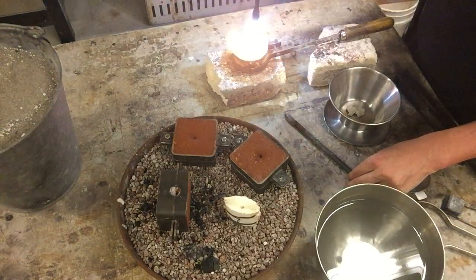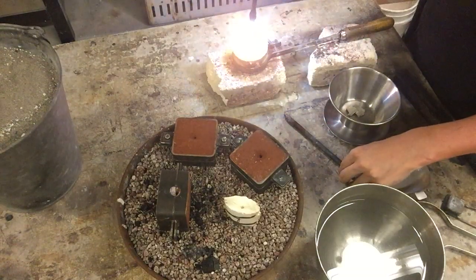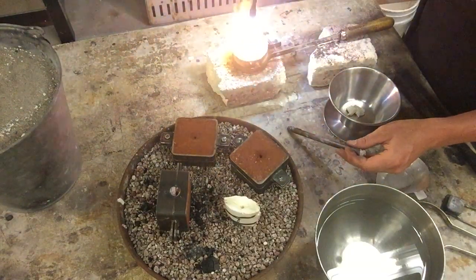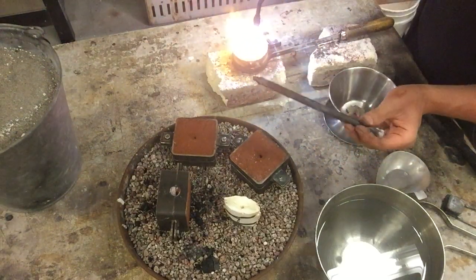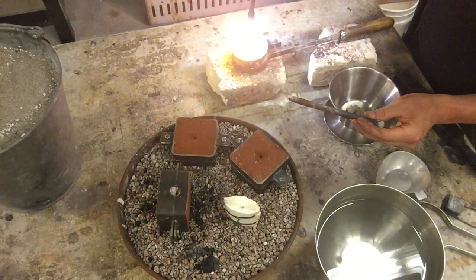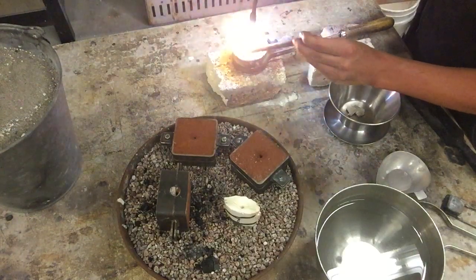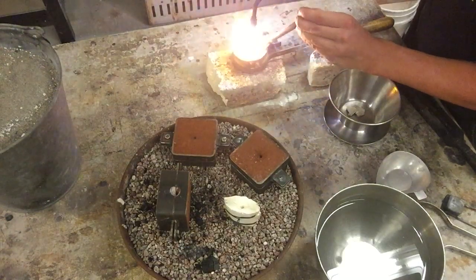Now we just need to slowly heat it up, make sure everything is molten again, and that's going to make sure our alloy is nice and uniform. I'm turning my acetylene up because my flame isn't coming outside the crucible enough and I don't want my metal to oxidize. If you're not constantly stirring with the carbon rod to introduce electrons and keep the metal clean, you can adjust that by turning your acetylene mixture up a little bit — that will also improve the melting properties of the alloy.